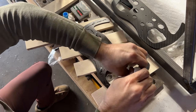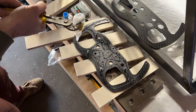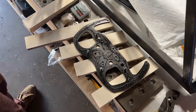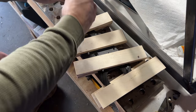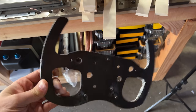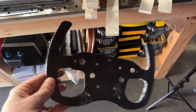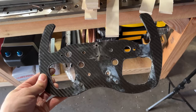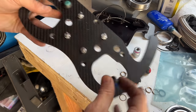Once that's all done, I can glue it together. I used super glue for this — it's a pretty good composite glue. We'll also have bolts through all the layers, and the grips epoxied around, holding it all together. I clamped it all down and let it set overnight, then went back and unclamped it to find it looking even worse. This white film happens a lot with super glue — not good. As I said, the most important part of a race car steering wheel is that it looks cool, and this is looking pretty not cool. Fortunately, with a little acetone, the film came right off and it cleaned up nicely.